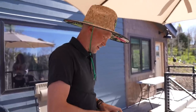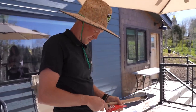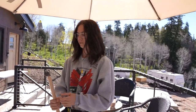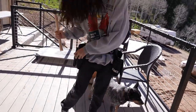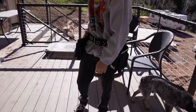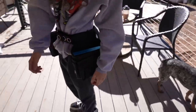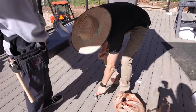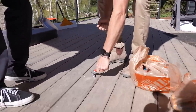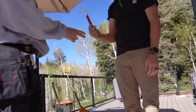Okay. All right, so this is gonna be your best friend and most likely your worst enemy a little bit. Chopping wood was preparation for all of this. Now figure out where it goes. I don't know, man. What would a handyman do? Okay. Perfect. So you want to put that point down. Yep, perfect. This is for when a nail gets driven in the wrong place. So you're trying to get this nail out right here. You take your hammer, you take that at an angle like that, and you pound this into the wood until it's under the nail, and then you pry it out. It's called a cat's paw.